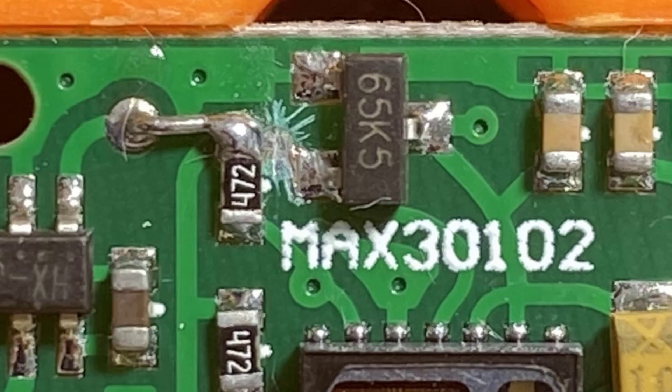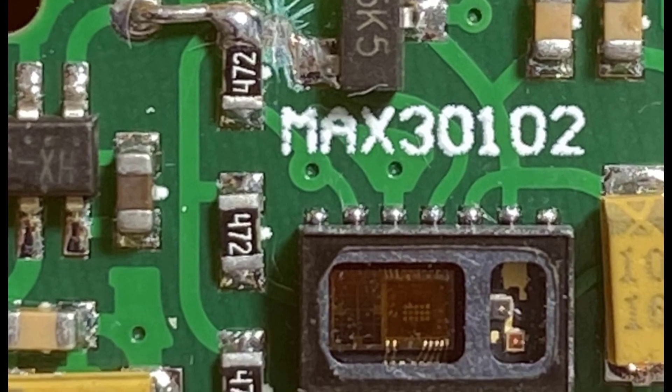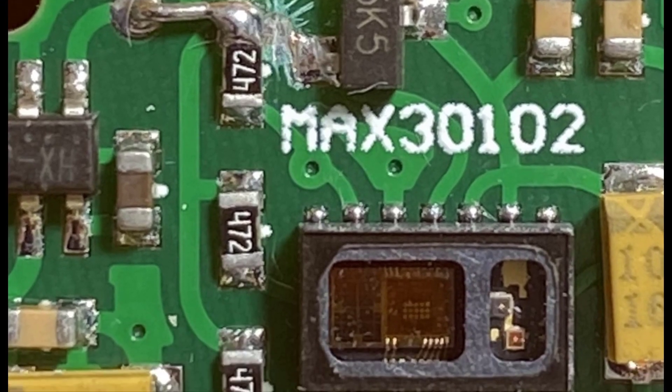There are two ways to do it. Method 1: cut this PCB line and connect the pull-up resistor to the 3.3V pin of the regulator. You don't have to connect all resistors individually, because all three resistors are internally connected on the PCB as shown here.